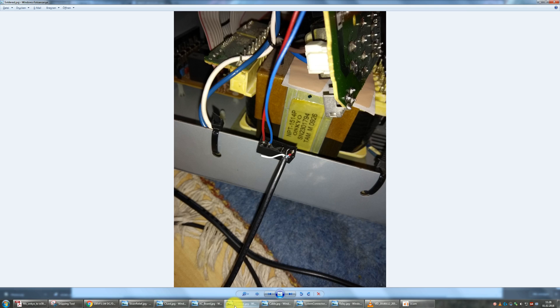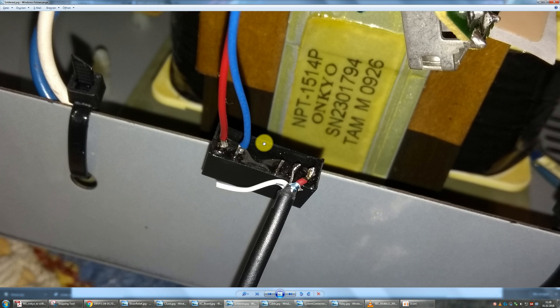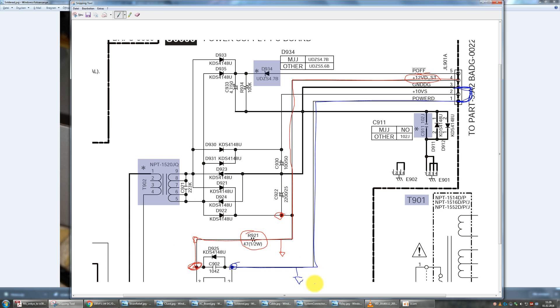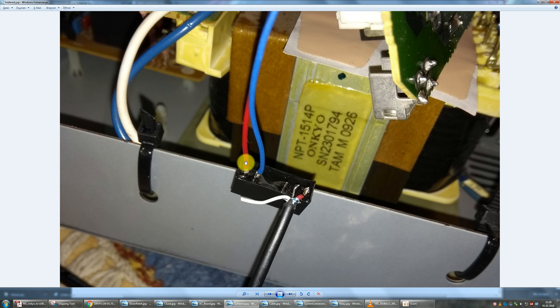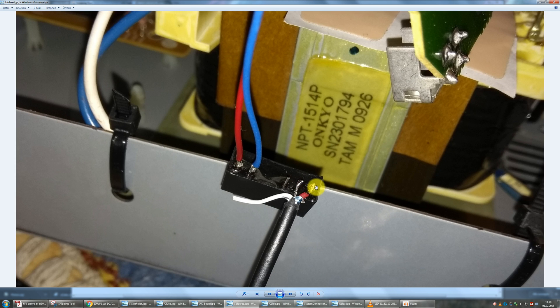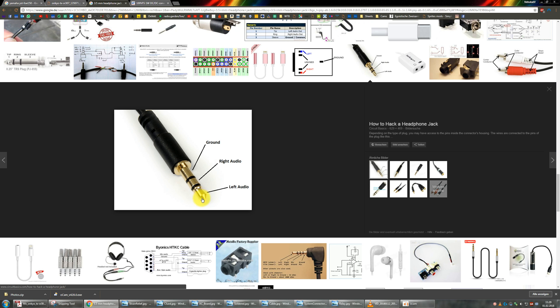You can then go in and solder on this DC-to-DC converter. Here you can see the DC-to-DC converter I used — as I said, it's five pins. There is this negative rail which I didn't use. The inputs are coming from the supply of the original relay inside the amplifier, and the output is going to this headphone jack to the system connector. I used the screen as ground for the center pin, and the tip — which was the red wire — to plus 12V. So I created a headphone jack that has plus 12V on the tip relative to ground when the amplifier is turned on, and zero volts when it's switched off.